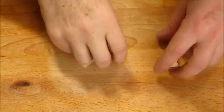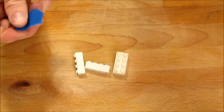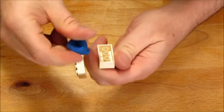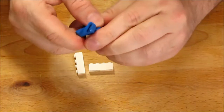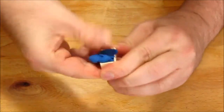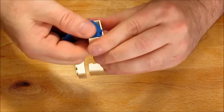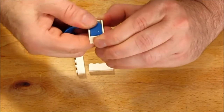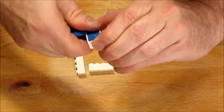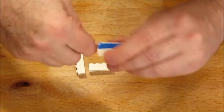We'll try to turn these into metal. We have a few Lego pieces we're gonna prepare for molding. We'll make a silicone mold, but what I want to do is fill the back of these to make the mold a little easier — not completely, I need the last couple of millimeters so that they will latch together, but I want to fill most of it so that I don't have to worry about the mold material getting trapped in there.